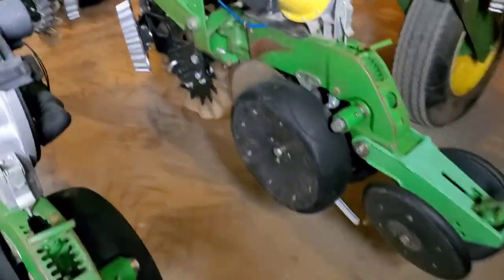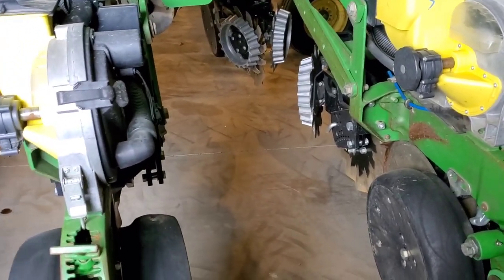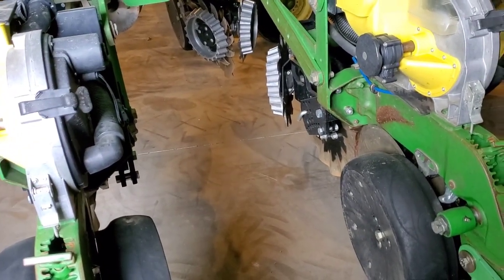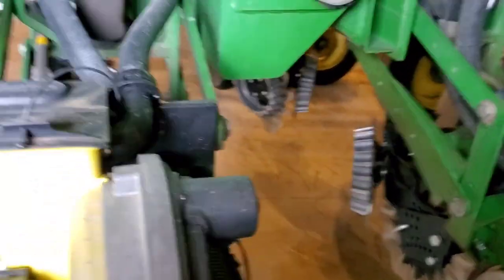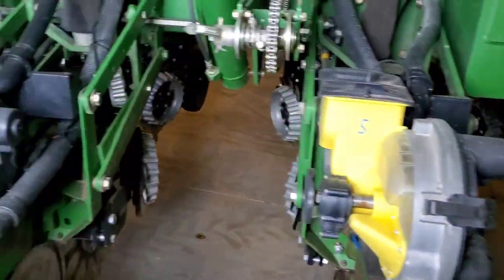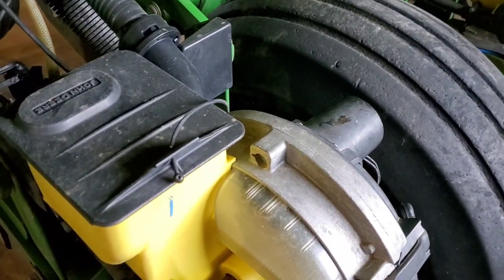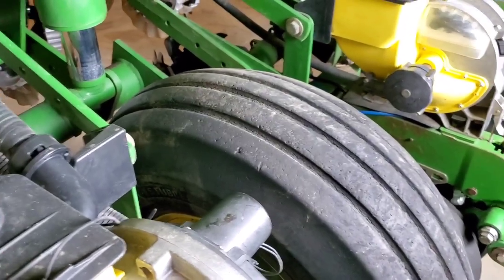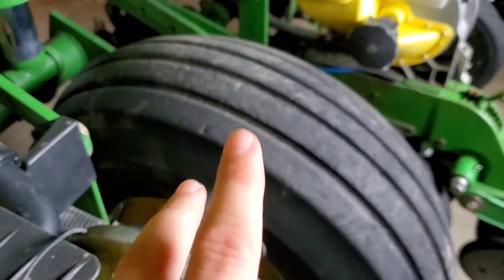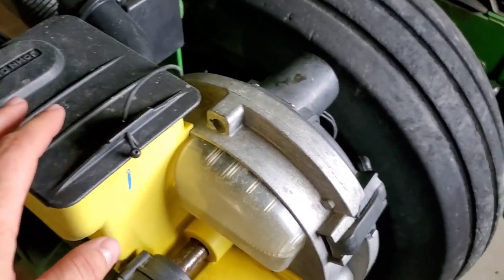That's about a 2012 model planter, and that's when you're getting into a vintage that's a little bit more user-friendly, we'll call it. Because at that point, you're no longer having to combine two electrical systems or modify a current system. You're actually with a factory integrated system through one wiring harness. And yes, you can put that on this planter, but it's about $35,000 just for the wiring. So by combining a 350 monitor adapter harness, an Ag Leader clutch, and a John Deere rate controller, we're actually able to pipe everything through one ISO bus plug-in on this, but we have to have two run pages on our 4640 display. One page devoted to the planter, another page devoted to the rate controller.